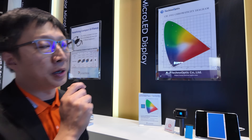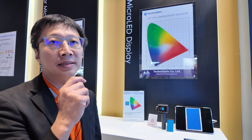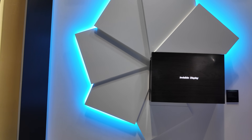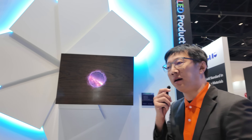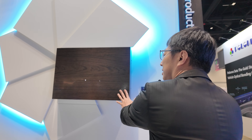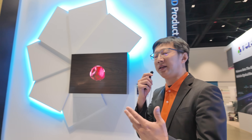This display uses four primary colors to compose a higher CIE color gamut. And here is a special material demo: a 15.4-inch micro-LED display behind an acrylic plate, with a wooden stripe film attached under the acrylic plate. The original brightness from this display is more than 7,000 nits, but after this film is applied, only about 600 nits remain.